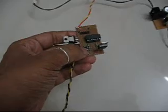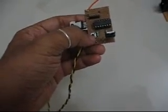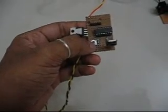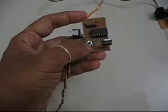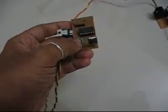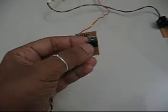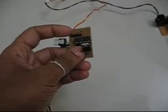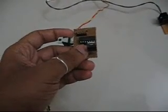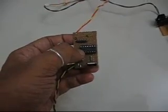This is the push button key. It basically does three functions — it runs the motor in three different speeds: one at the highest speed, then at the medium speed, and then at the lowest speed. The lowest speed is zero speed. This is the Darlington transistor TIP122, with a 5-pin circuit for programming the PIC16F684 controller.